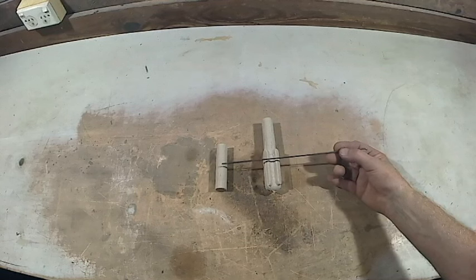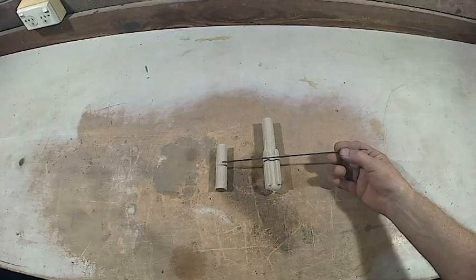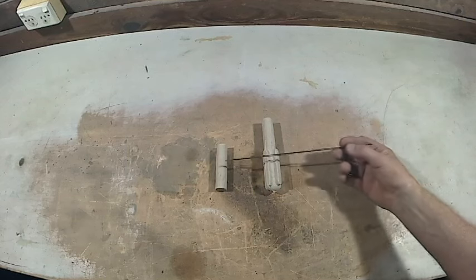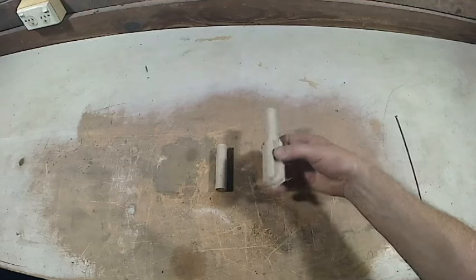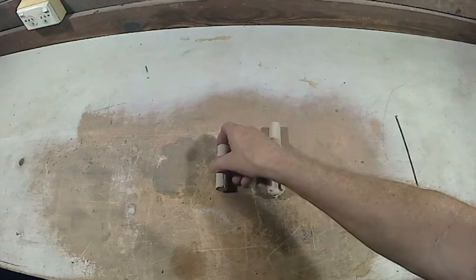The plastic started getting too hot. So this is where you'll have to be careful and try and use the minimum amount of time with the microwave oven. And maybe just let them cool down and sit for a long time and they'll go completely off. But they do work. Both these cores are very strong. As you can see, I can pick them up. And the microwave oven does work to harden sodium silicate.